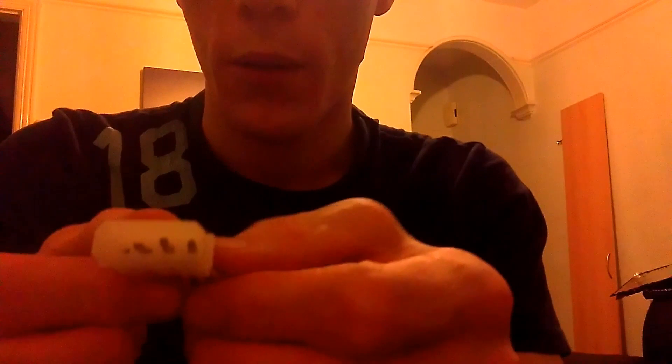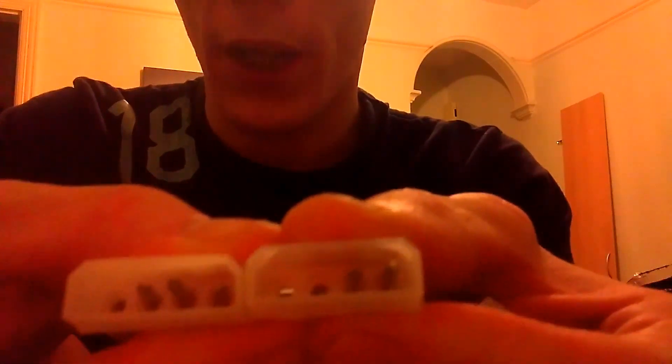As you can see — looking at the rounded corners to confirm they're matched up — we've got the yellow wire for the live, a black ground in the middle which we're running a red cable for, and then another black ground directly next to it. Looking at the other adapter for comparison, you see the live and the 2 grounds matching up perfectly.